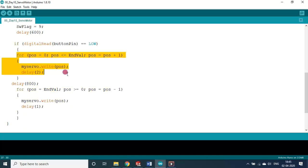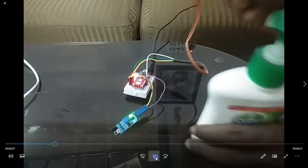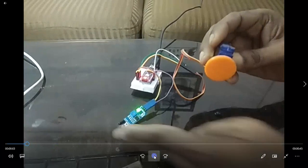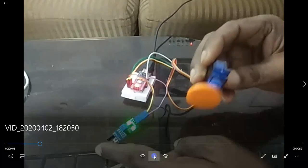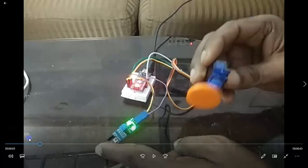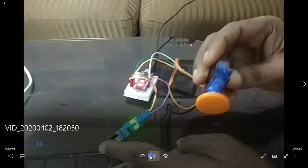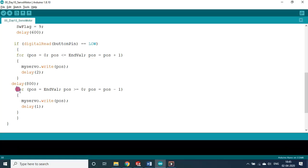From this viewing angle, the first rotation direction is anti-clockwise, making the return stroke clockwise. In the forward stroke I used a delay of 2 milliseconds per step, but in the return stroke I used 1 millisecond per step — this makes the return stroke faster than the forward stroke.